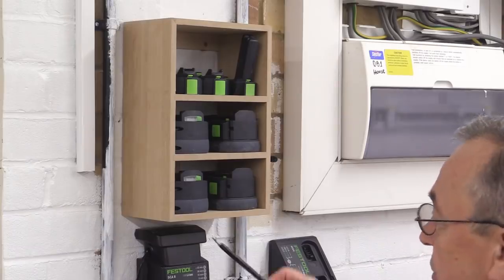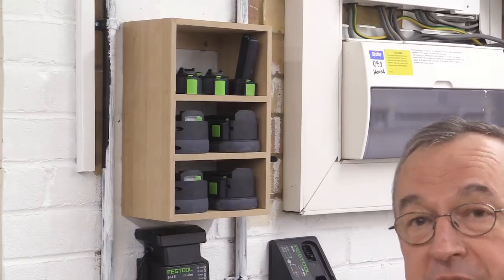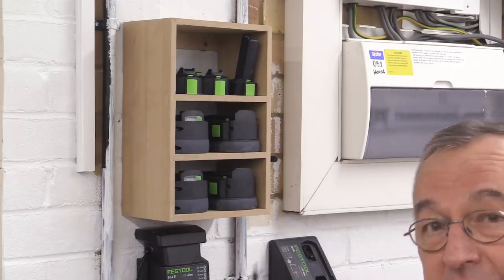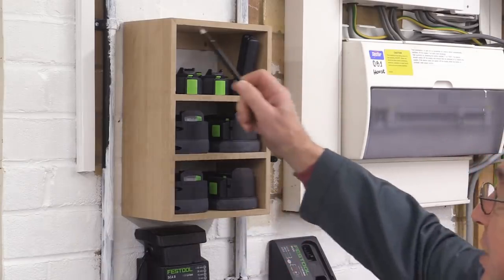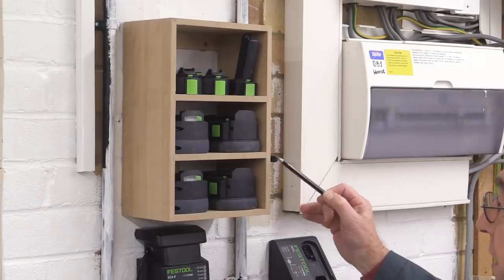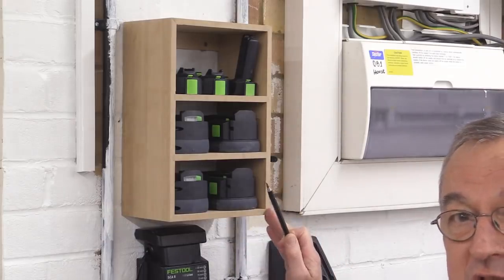The construction is very simple. At each of these four corners are mitered joints, and this is a technique I've shown in many of my other videos, where you make a miter joint and use some masking tape to bring everything together with some glue. It's going to be strong enough for drawers and all sorts of other applications. That's the outside, and then I've put two shelves in here with a rebate cut at each position, so those shelves are just the right size to go in those rebates and the whole thing comes together nice and square.